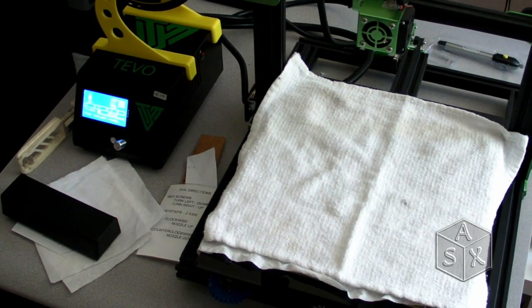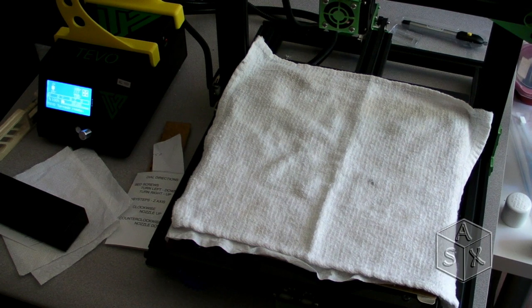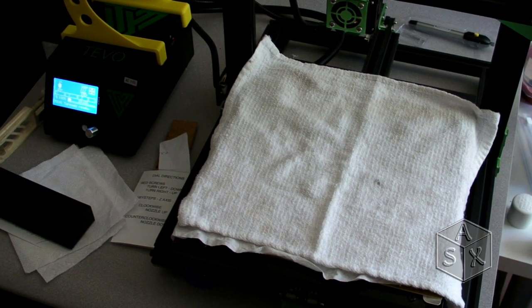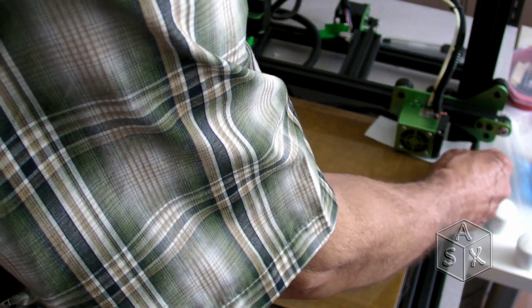Okay, it's been a little over 15 minutes at supposedly 100 degrees C. I'm going to shut her down, let her cool off, and then we'll level the bed again and attempt to make our first print, which we'll video. See you later. Okay, we got the bed leveled. Paper. Nice and easy.